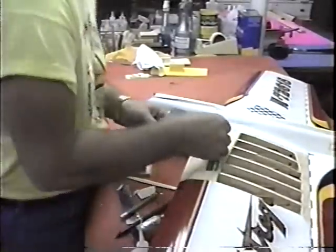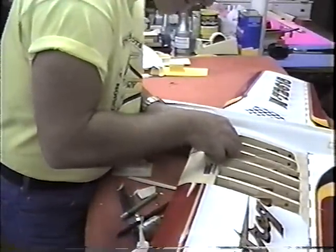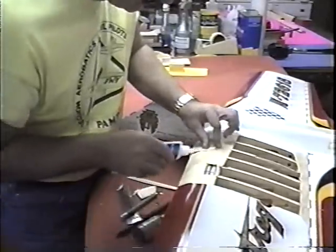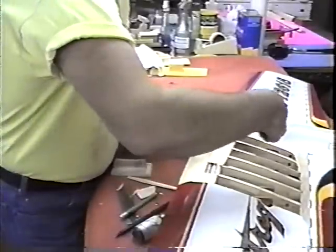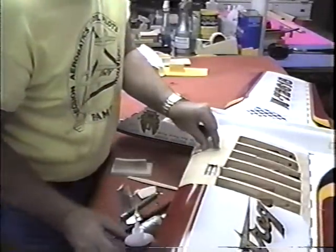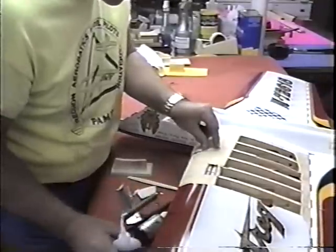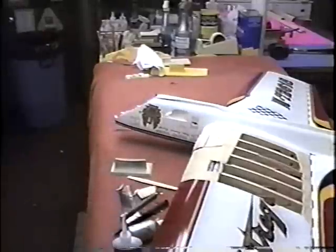If you put just a little bit of a draft angle on this, on all dimensions, one of the things it allows you to do is just set a piece of wood in place. And it'll go in just like a cork in a bottle. And we don't really care if it's a real nice fit right now. When we start sanding and filling and sanding and filling tomorrow, then we'll start getting fussy about this. But right now, I think that's going to get us through.